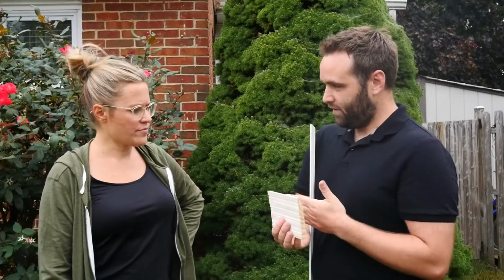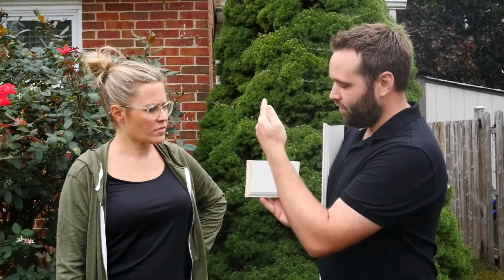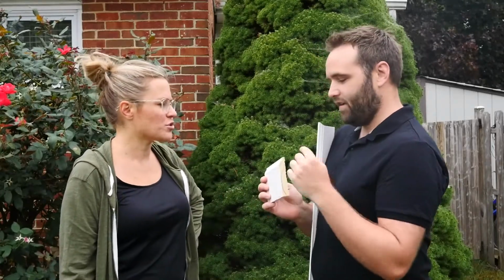So you use something called a coping saw to cut out the profile. So what you can do is after you cut your 45 degree on a miter saw, you can flip the piece over, and you can run your saw and cut that straight line all the way down before the profile starts. Okay. And when you say profile, you're talking about that sort of decorative edge at the top of crown. Exactly. The little trim, and they all have different. This has a two-step on it. Some are just rounded over. So it just depends on the base trim you're using.